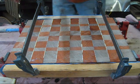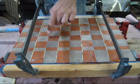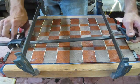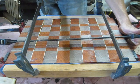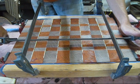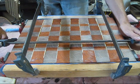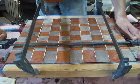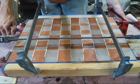Remember, you don't have to tighten the snot out of it. You just want to have good contact. If you have glue coming up out of every one of your joints, you're in good shape. So one more clamp in the middle. I'll bring that sag on up. There they come. I got good glued contact there. Alright. That ought to do it.